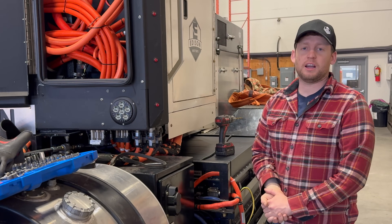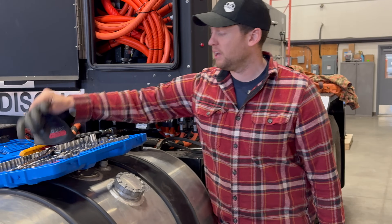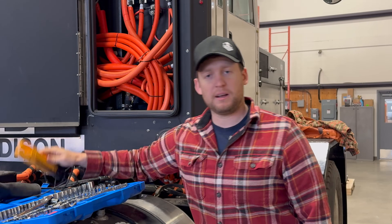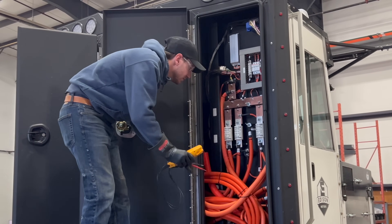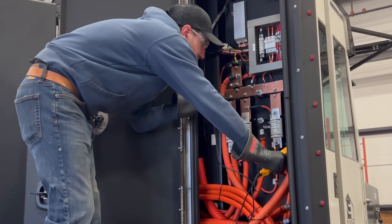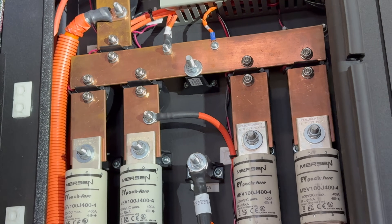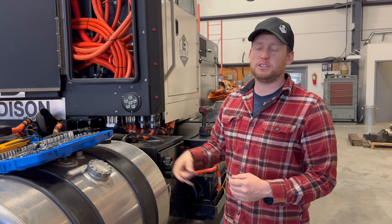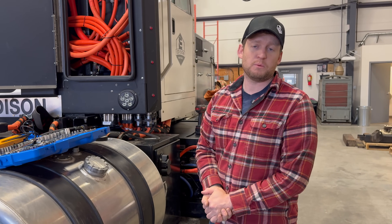Because we're going to be working on the high voltage side today, we've pulled out the plugs on the batteries. What Eric's going to do is put on these special high voltage gloves, climb up there with a voltmeter, and check to make sure the system's off. Even though the batteries are disconnected and the generator's off, you still want to verify. We're 99% sure there's no power, but you always want to check — you don't know where there's going to be a capacitor storing power or something in line — so he's going to check all the high voltage cables leading to the box to make sure it's safe to work on.